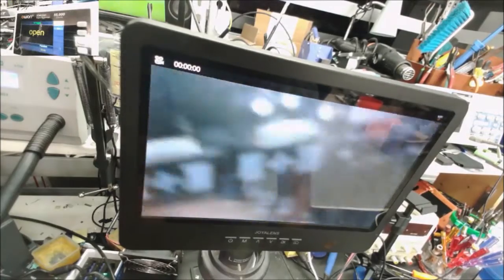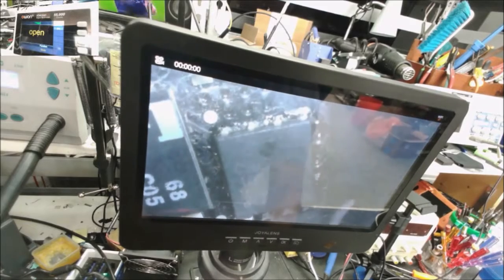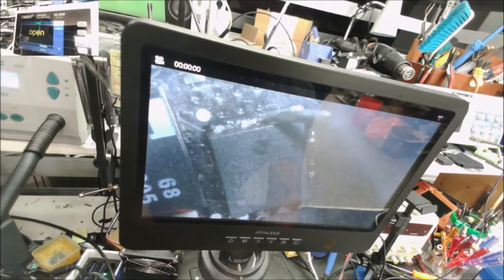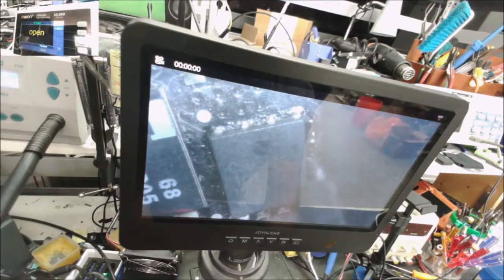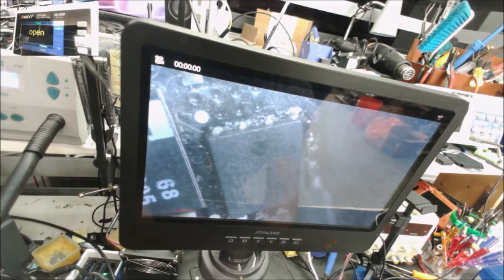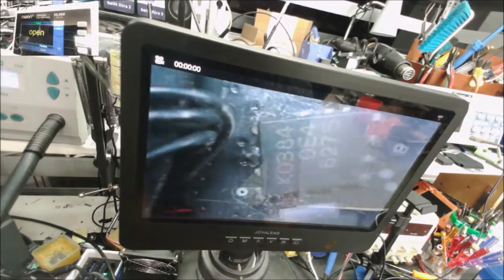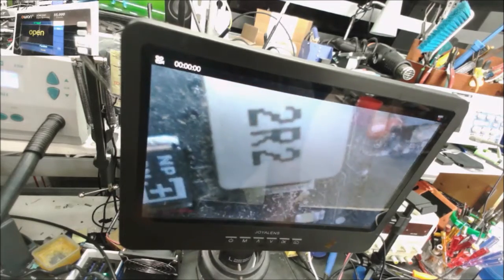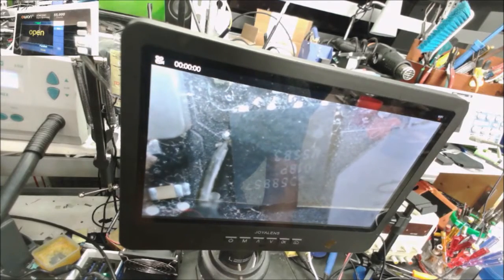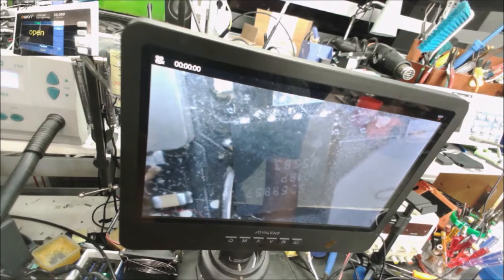The other spot is right here — you can see some melted flux. It does look like a solder ball over there. This MOSFET was under heat. And another MOSFET right here — look at this solder ball. So these MOSFETs were under heat.